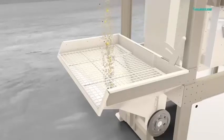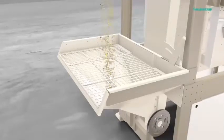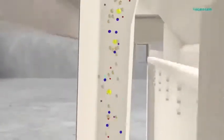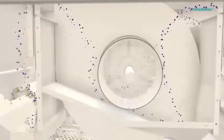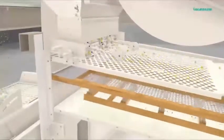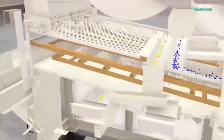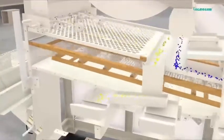In Deluxe 2, the material is fed into the low-level feed hopper, which has a feed roller and feed control gates. From there, it is sucked up by the aspiration fan and dropped on the top sieve. This primary aspiration removes straw, dust, and other lighter impurities.